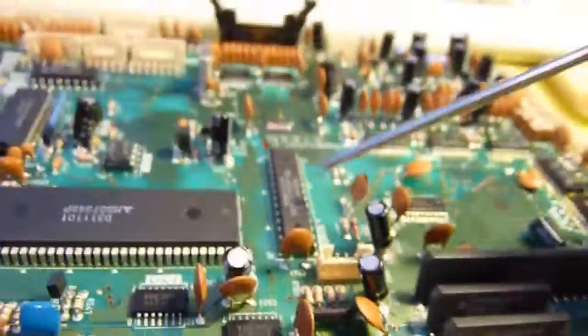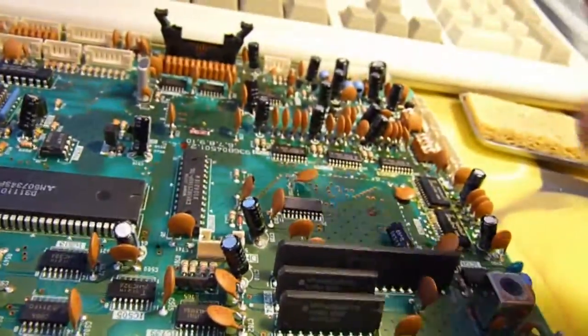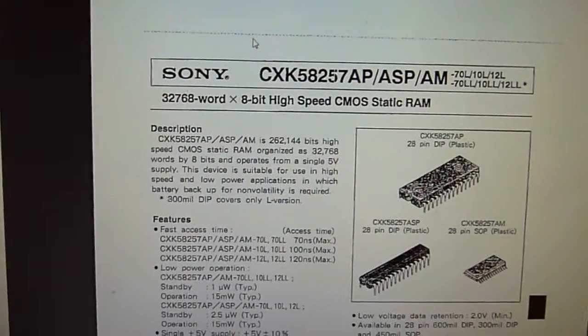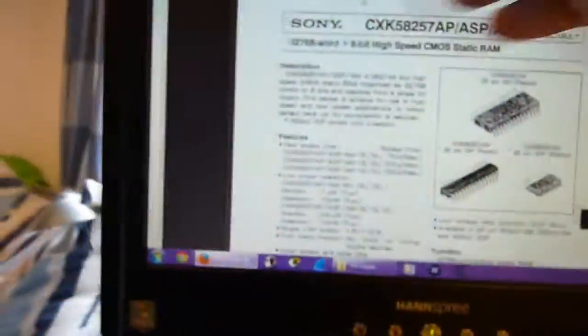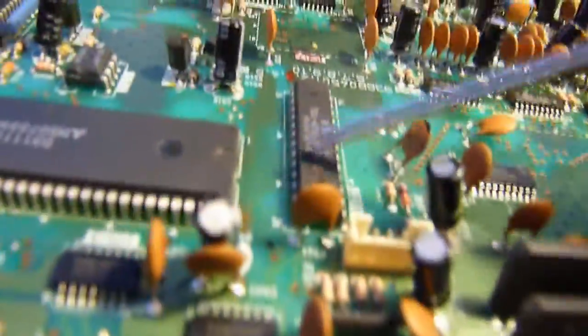And so this one, looking at it, I would say it's probably about 256 kilobit again, but once again, they're never particularly clear. 32,768 words. You know, a word means anything above 8 bits. You know, 16-bit word. 32-bit word. Yeah, doesn't really tell me the memory capacity. If maybe you said bits there, we could work with that. Maybe it's 32k. Could be, looking at that value. Yeah, let's say this is 32k, looking at that value on the screen there. That makes sense. I'd have to do the math to work it out completely, but we're going to say it's 32k.